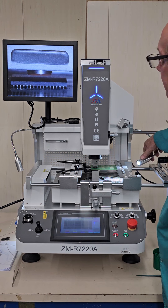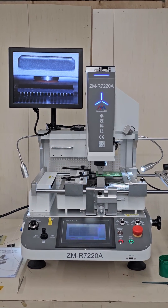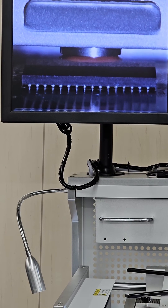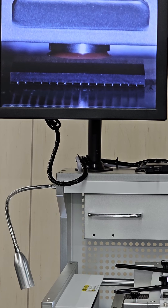It's going to run the heat profile now. It'll take about five to six minutes, and then we can watch the solder balls reflow on the side view camera. The solder balls are going to be reflowing soon — we'll zoom in to get a good look. We're starting to reflow now, and we now have a complete reflow. After the complete reflow we give it about 30 seconds. We'll note what temperature it reflowed at, go back and readjust our profile for that temperature, and basically we want to hold it for about 30 seconds in liquidus.